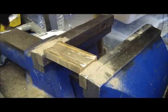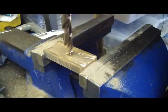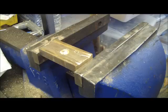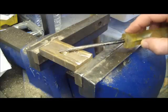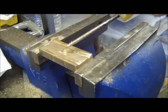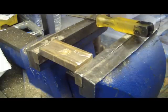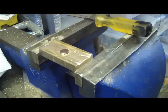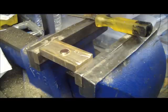In keeping with the theme, I've center punched this, marked it, and now I'm just going to drill it by hand so that we can epoxy in a magnet. I just cleaned out the hole a little bit with the file. Now I've got my two-part epoxy, and the trick for body men everywhere — when you're mixing it, when you're absolutely certain it's mixed, mix it a little more. Then you've got it for sure. These neodymium magnets are quite brittle, so just be careful with them.